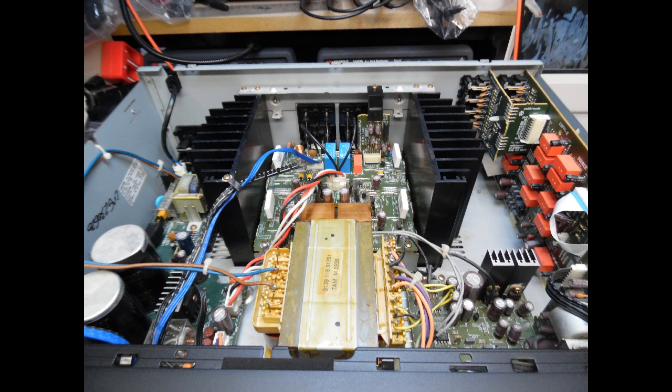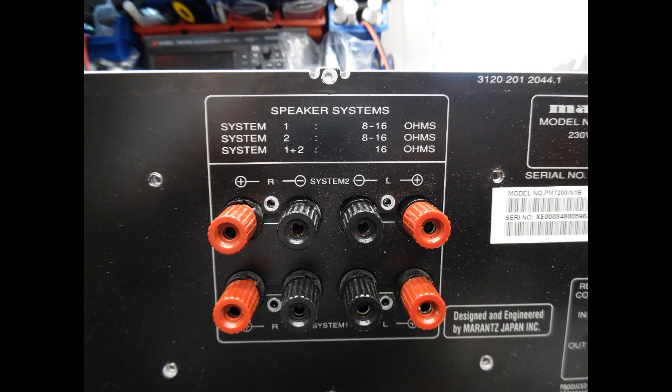One important thing to highlight: there is a common ground point around the rear speaker terminals. When the screws are removed you'll see bare metal — that is by design. When doing repair work, ensure the back panel is connected to the overall chassis and that the rear grounding screws are connected to the main amplifier module. If you don't do that, you've broken one of the common ground points for many of the other circuits.